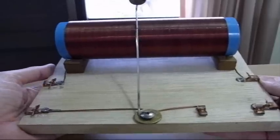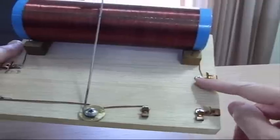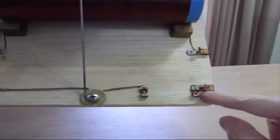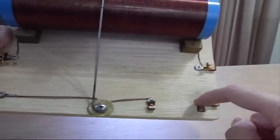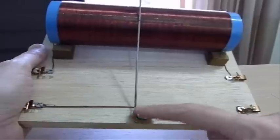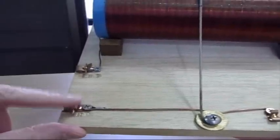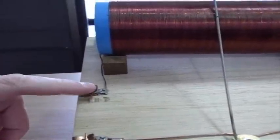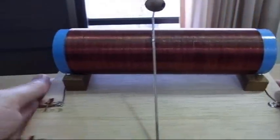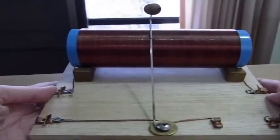This is pretty much it. The wire comes out of this side of the coil, comes down here — in this case soldered onto this clip. A resistor will go across here, and the earphone will be connected here. These two clips are just screwed together. The diode goes here, then there's the wire to the wiper as we showed earlier. A wire goes over here to the contact for the ground — hook the ground wire here. Back here is the antenna wire — this clip goes to the antenna, and then it goes into the coil.